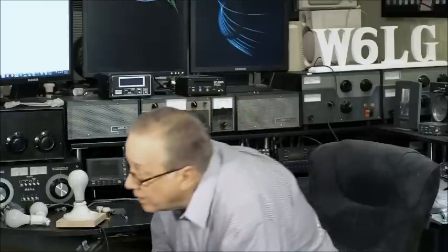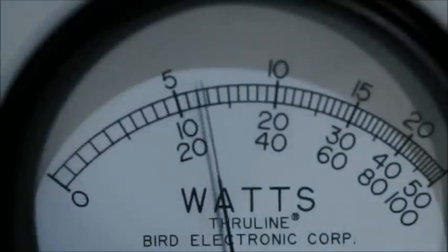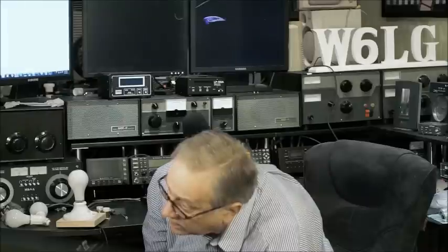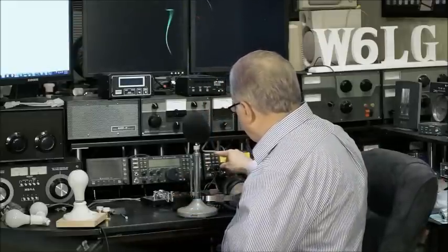Okay, I'm back — let's do the RG8X and see what happens. I'm going to dial up a hundred watts again. That's exactly 100 watts — and that reads 70. Precisely 70 — it's dead nuts on 70. So I'm surprised by the amount of loss; it's significant.